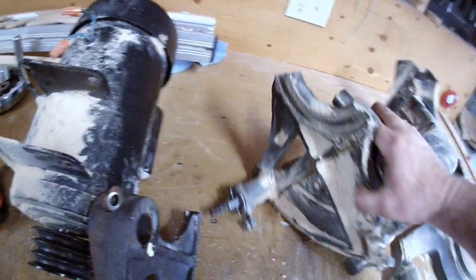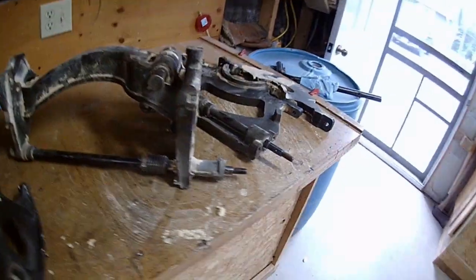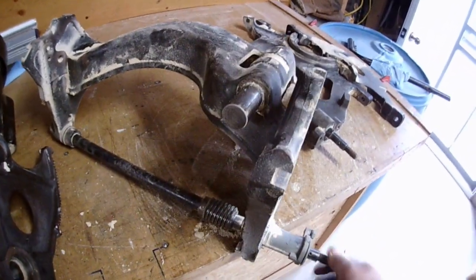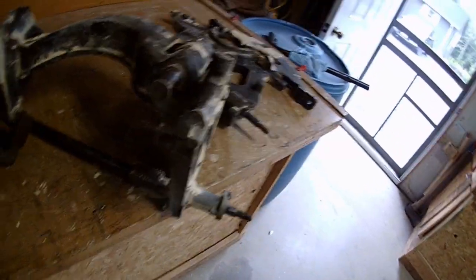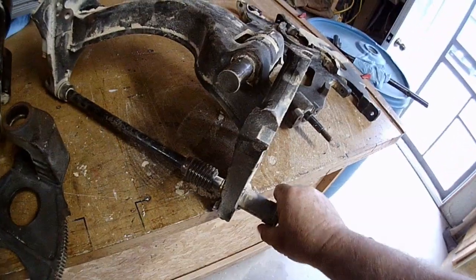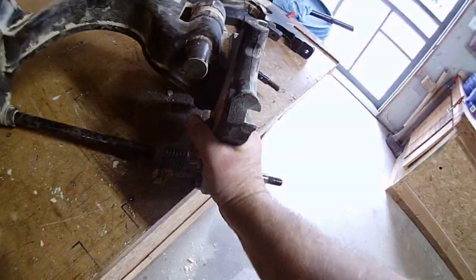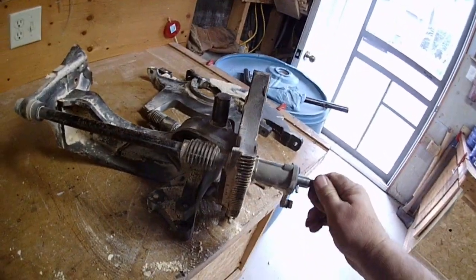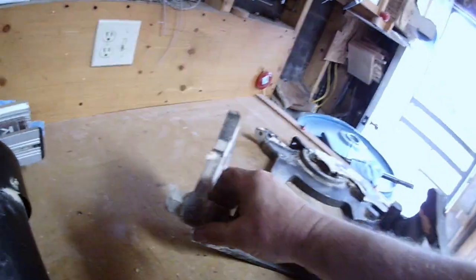This mechanism here is for raising and lowering the blade. This screw turns on the trunnion — a gear on the trunnion ran in the screw feed, and as you turn it, it raises and lowers the blade. That's hard to turn — there's a stiff spot in it. I'm sure there are just bushings in there, and it's probably just dirt.